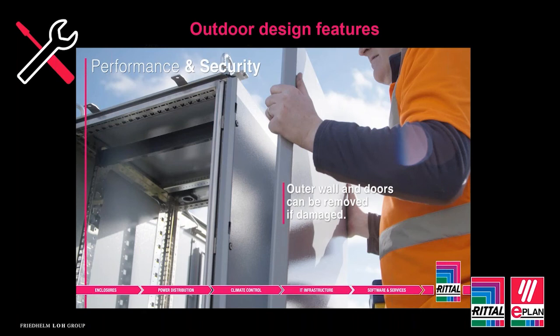There's huge amounts of cost, huge amounts of downtime in that. A lot of that could be saved if we were to use a double skinned enclosure. What would happen is, if the outer skins are damaged, literally we could just order the outer skins. Those could be brought to site, those could be swapped over, the enclosure will still stay in its original position, and all we need to do is change the outer skins when they're available. Again, that saves huge amounts of time and downtime to the railways if that's the application that we're looking at.